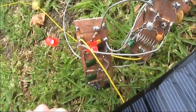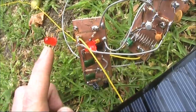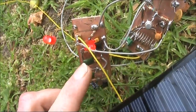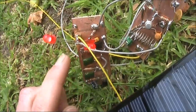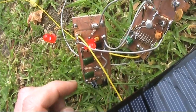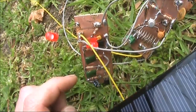As you can hear in the background, for some of that cycle the tone is modulated when both the audio oscillator and the RF oscillator LEDs are in sympathy. But when they're not, the RF oscillator may be transmitting an unmodulated carrier. That creates a long term repeating pattern over three or four seconds.